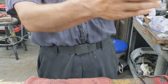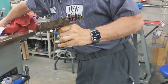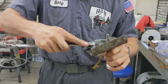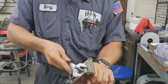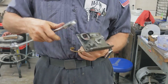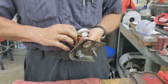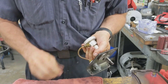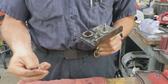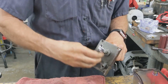Make sure your position is set so that when you put this back in it's in line with that. Get our wrench — this one is a one inch; most of them are one inch, though I've run into a few that are a different size. So snug it up. Next step, we're going to reinstall our line — three-eighths inch. Put our nut back on the top — all this is for locking your handle on, that's all that this does. Handle back on.